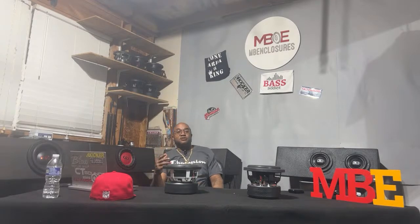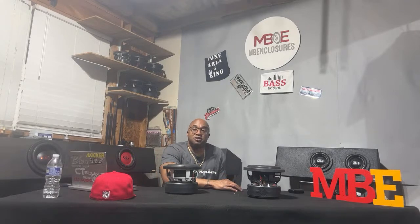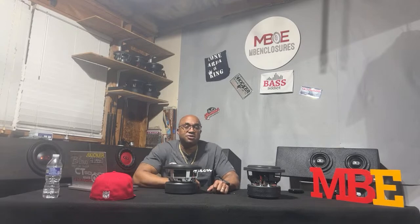The motor force and the Qms do not work well on that subwoofer. It has more motor force and thus needs a bigger box than that spider will allow for it to do. It's got a super, super stiff suspension. But even when, man, bro, I done broke mine in for hours. They just sitting over there now. I got tired of it. Both of them sitting right over there.